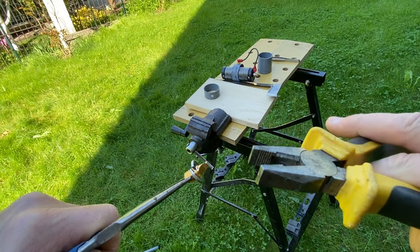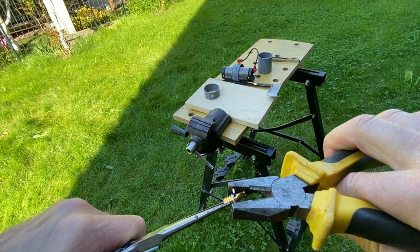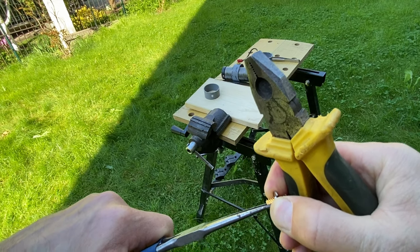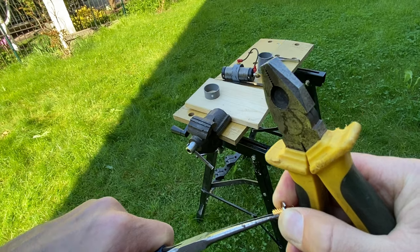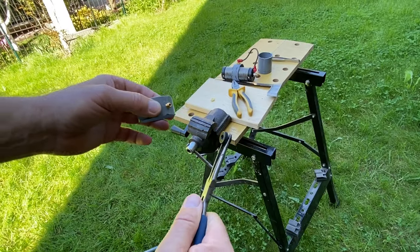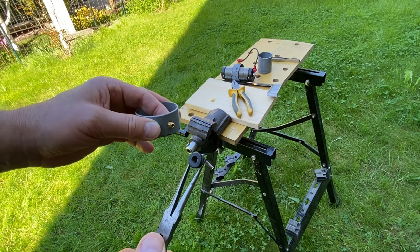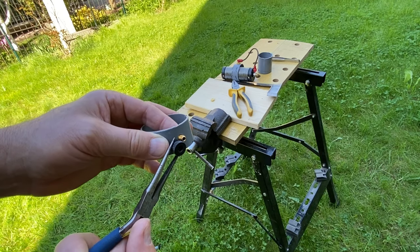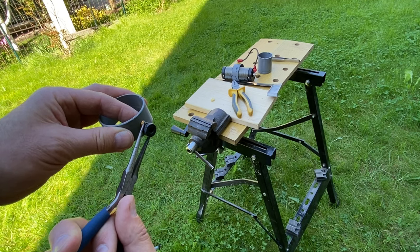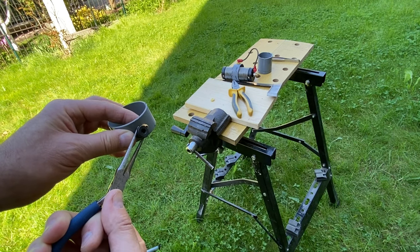So the modified washer nut sits on the bolt, and we need to carefully squeeze it so it sits firmly and doesn't go away with the tension. Now the tricky part number two: the nylon nut, which originally goes onto the coil clip, is too big here. If I screw it on the bolt as it is, the banana plug will not reach the contact. So that's no good — it means we need to split the nylon nut in two.